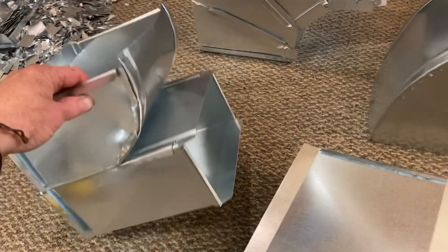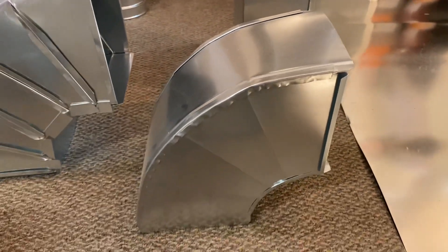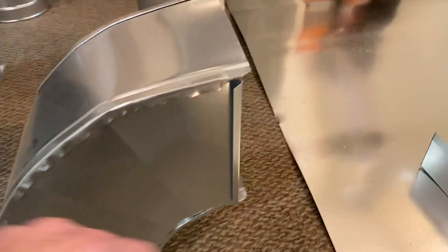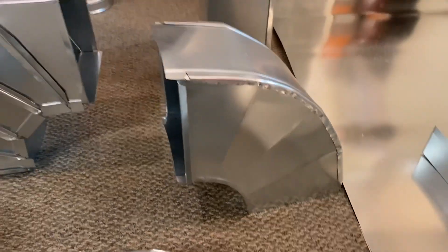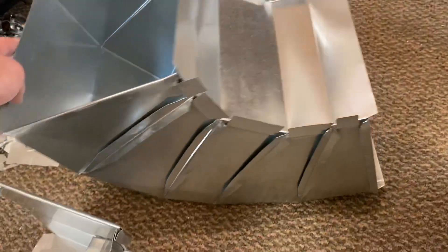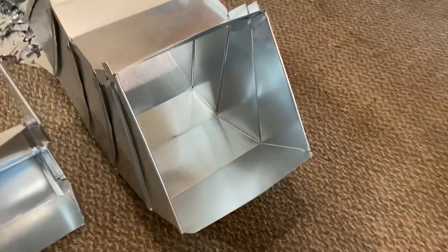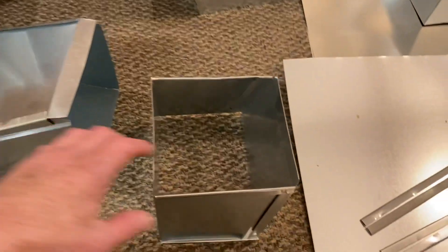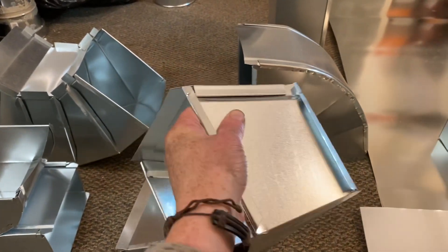This here is a mess-up — it was a split fitting. Looking at the curved 90 degree elbow: all this I did make on the brake and this has been an evolution. The five mitered segmented elbow in the background is kind of how I first started out, and then as I watched YouTube videos and found online guides I improved my fittings. I figured out how to do the rounded after I did the five mitered, so I ended up using the rounded instead.